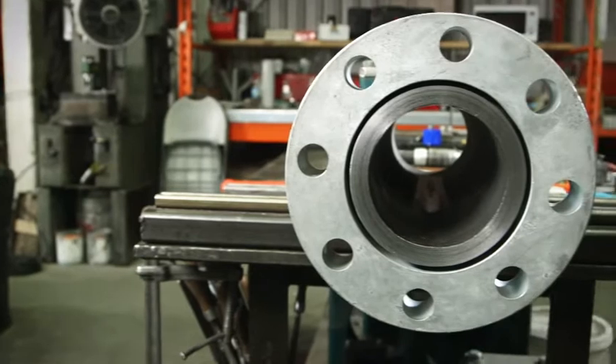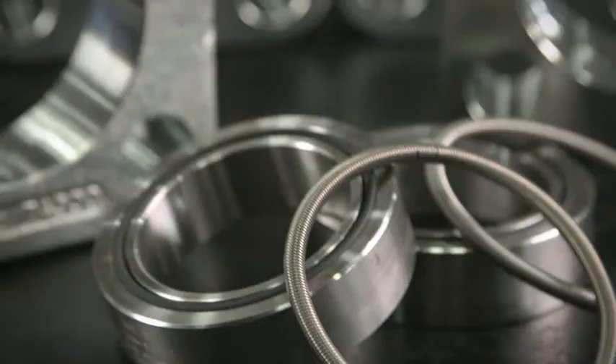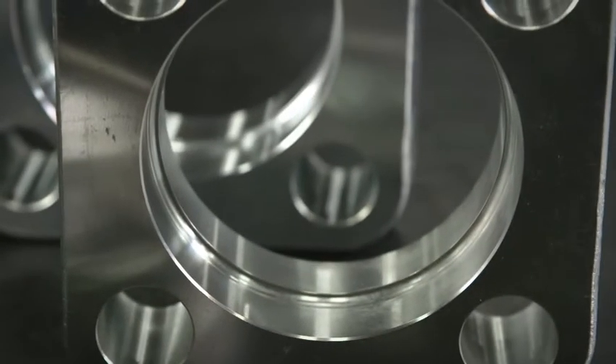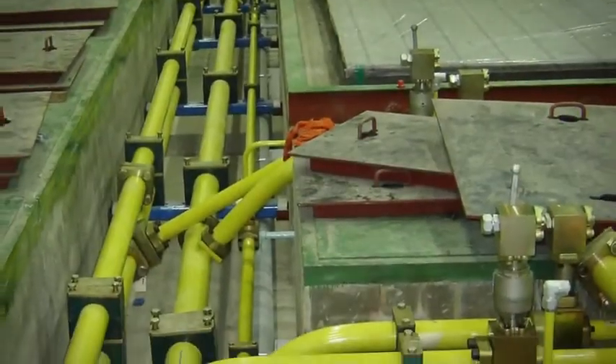There is no need for x-rays or acid cleaning. It's fast and easy to install. The retain ring flange is available in carbon steel and stainless steel in both imperial and metric sizes. The flange can be rotated prior to bolting, making installation easier, especially in tight places.